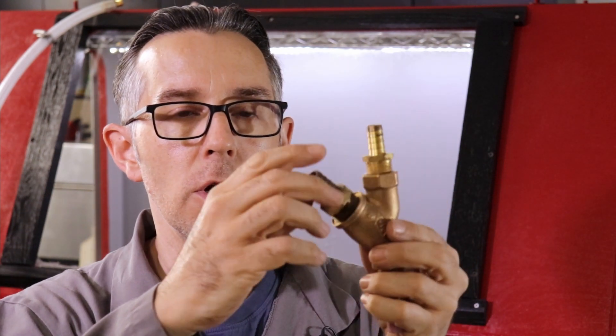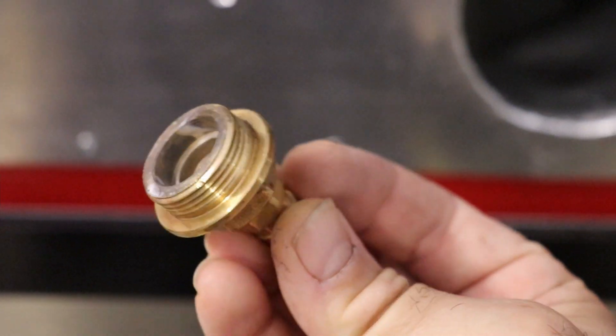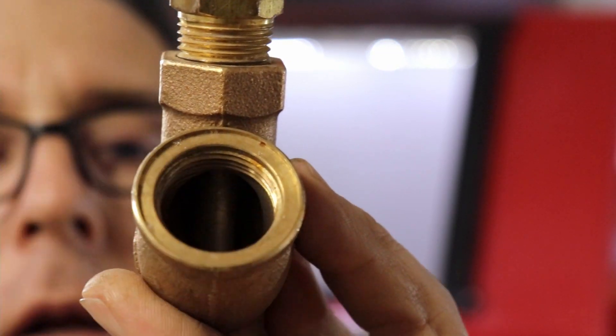The slurry line is three-quarter inch and the airline is half inch. The body is made out of a strainer, and where the three-quarter inch line attaches there was originally a cap. I took all that off — before I upsized the slurry line I had drilled and tapped the cap for half-inch line, but I found it just wasn't getting enough flow. I've got it all loosened off now and the three-quarter inch barb is off.